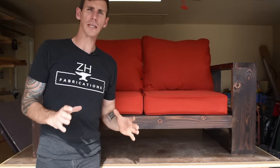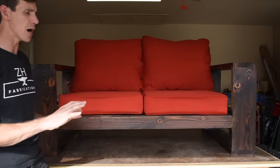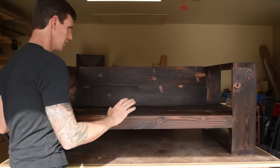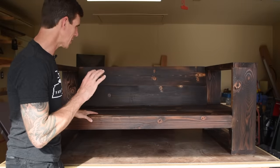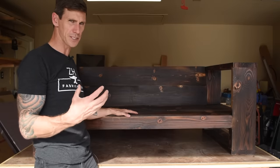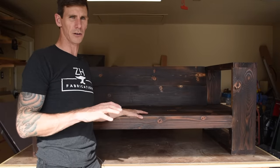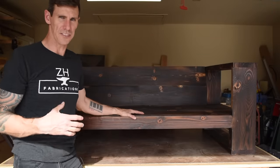So thanks for watching. I really love the way this sofa came out. It's a super simple project but it's got a very cool look — a very modern, sleek, minimalist design, and it's sort of convertible in the way you can use it with the cushions or without. The Shou Sugi Ban torched-wood finish gives it its own special unique character. It's going to help make it more impervious to being outdoors, to sunlight and water, but you don't have to do that. If you don't have a torch you can just leave it as raw wood and put a sealer or protectant on it to make it withstand being outdoors. I prefer to torch the wood — I think it looks cool.